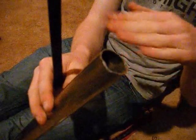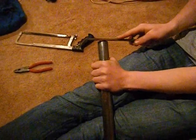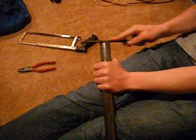After you've done this, sawing all the burrs down and stuff, you're going to need to take a file like this, and just file down all around here if you tore it off, and make it level even if you didn't. Just rub it up and down like that, and there we go.